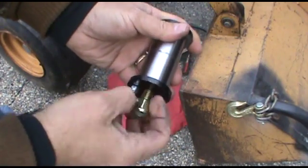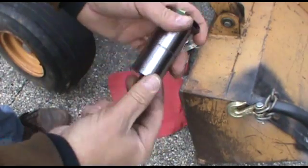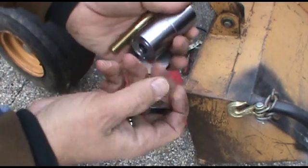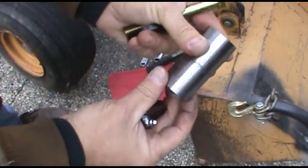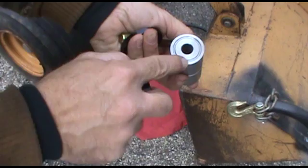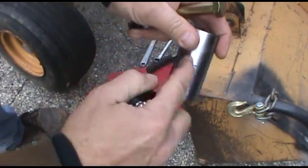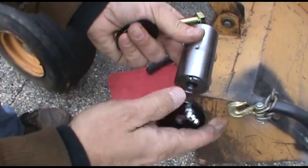This is the new improved axle pin. Just to give a close-up, you have the two main machined washers with the machine pin, and then your through bolt with the lock nut. If you notice on the pin, there's a groove with a greaser hole in it on one end, and that hole meets up with a hole here in the middle to get the grease out all around through the middle of the axle pin.